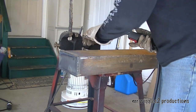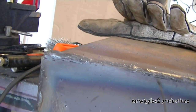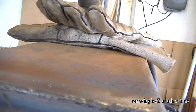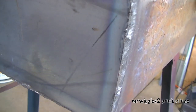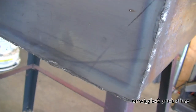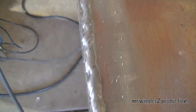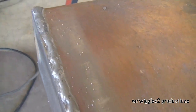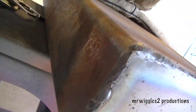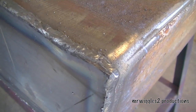Restart my bead. So that's the other end. As you can see, I got good heat penetration there. I used 100 amps. The next click on the welder would have been 140, and that's wide open, so I didn't need it. I got good heat, good penetration, good bead running about 260 inches a minute at 100 amps. So I got good penetration and melted those edges.